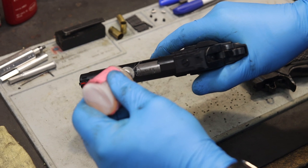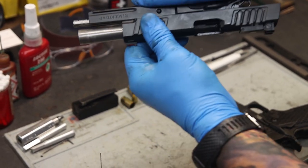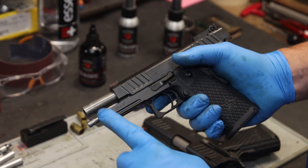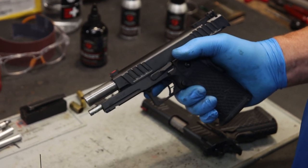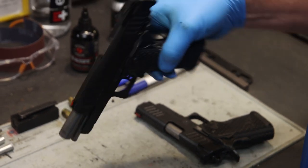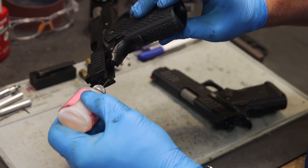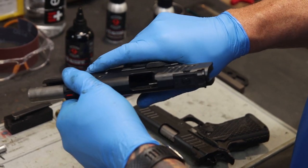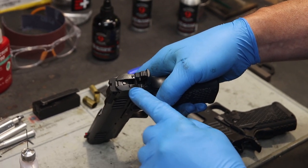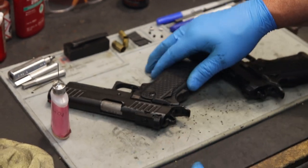The first place we want to apply lubrication is at the forward portion where the barrel intersects with the slide. Turn the firearm over and rack the slide three times — this allows lubrication to get into those barrel lugs and parts of the slide. Lock the slide to the rear. Pay close attention to the forward portion of the barrel and the recoil system and place a few drops there. Flip the firearm over and place a few drops of lubrication on the right side and left side of the slide rails. Rack the slide three times to distribute lubrication evenly throughout the firearm. Wipe off any excess from the back of the firearm with a rag, allow the slide to go forward, and your firearm is lubricated and ready for the range.